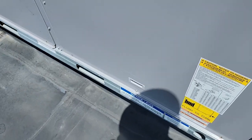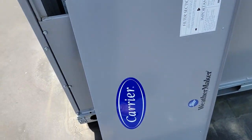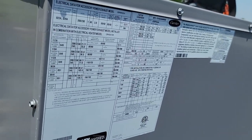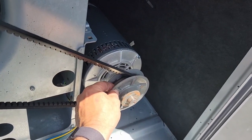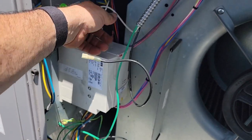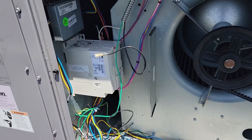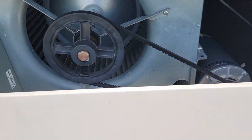Before we get started I might as well check the belt real quick, because the belts and filters are supposed to be done by the facility here but they haven't been getting done. Hopefully the new person will take care of that. It's a 2020 unit, so it shouldn't have too many problems. Belt doesn't look too bad. It's got a VFD — looks like it's still hooked up. Got wires going to probably the ultraviolet light system that are not hooked up. Since it has a VFD, they probably didn't know where to hook it — they should have just hooked it straight to power. Anyhow, let's go downstairs.